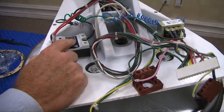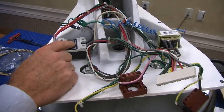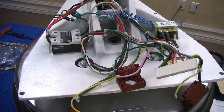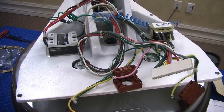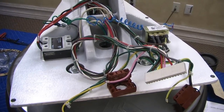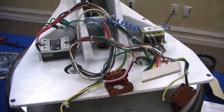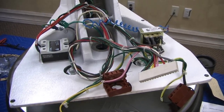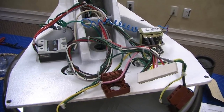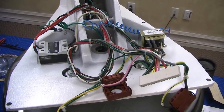The one way to do it, even before you put it in and test it, is to bring in another RTD and just plug it in on the outside. See if that solves the problem, that it's reading temperature and you see it's trying to heat. That would solve the RTD. I would do it on the outside, connect it, let it dangle down to ambient temperature, and see if that function is now relieved by the new RTD. Then you don't have to worry about what else is wrong. You just go ahead and install the RTD, and we'll show you all that later.